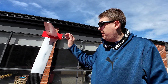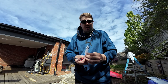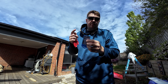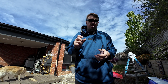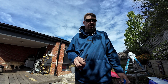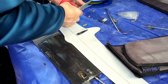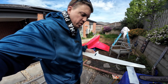Saturday morning — trying to finish off this foil angle of attack situation. I found an old Clamcleat backing card, which is thicker plastic and hopefully less compressible. I'm trying to get from 7 degrees down to 2, so I'll put a few layers in. I don't want to chuck it out so far that I lose enough engagement from the socket, but I also need the angle right or I won't be able to sail. I've added four Clamcleat backing cards and one Ronstan one — let's see what difference that makes. That gets me to 3.4 degrees.